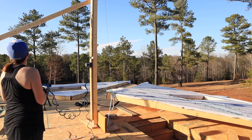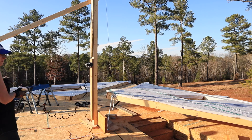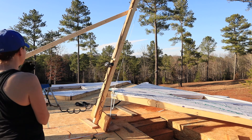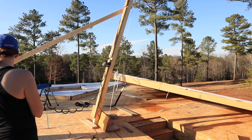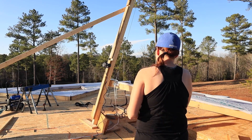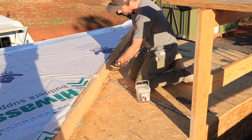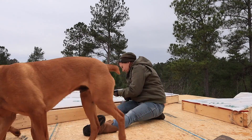When we tested this winch system on our first wall, we took it really slow to make sure everything was working and could handle the load. The only problem we had was the winch — if it wasn't perfectly level, the coil started to coil up on one side. As you can see here, it actually jerked over, which caused some sudden slack and a jolt. We also noticed the frame was really bending and buckling slightly, so we added some more 2x6s on the outside frame to give it extra strength while lifting.